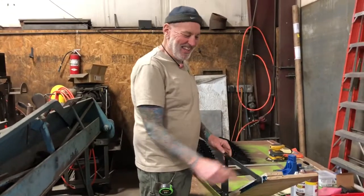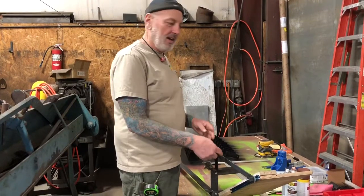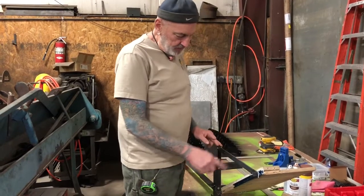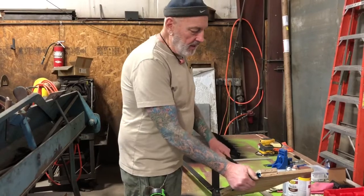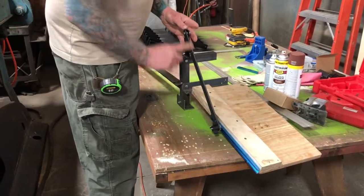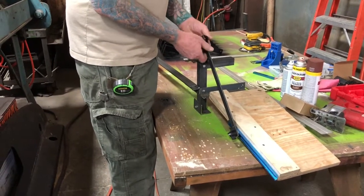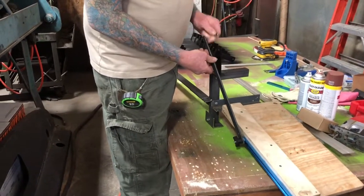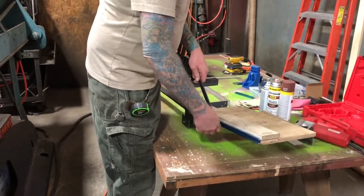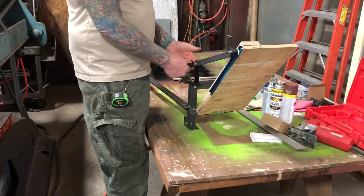You still got time to change your mind. I didn't like the rod sticking into where the deck is going to be. I didn't want to have to step over those rods or get tripped on those rods. So if I do it like this, I can get to that angle, which is short of the 45, but that lets me down onto the roof. And I've still got good leverage here. I'm not so in line with it, so I can hold it down better. I'm just going to punch an extra hole in this. So if I wanted to, I could compromise to get it to go up where I want, but keep it out of the walkway. Doing it that way, I could get the angle I want and it only really sticks into the walkway an inch.